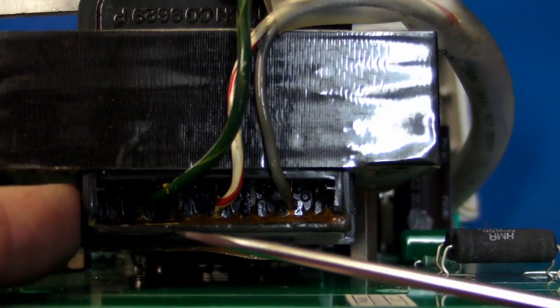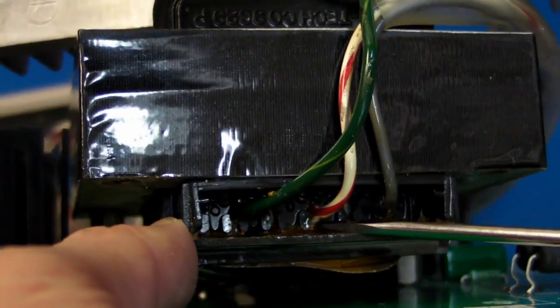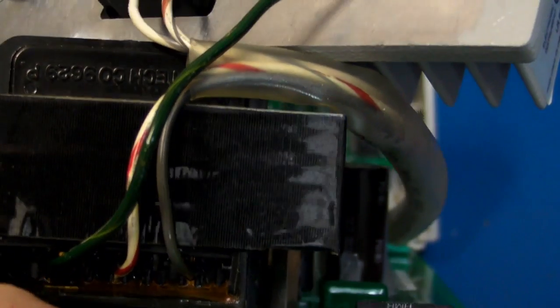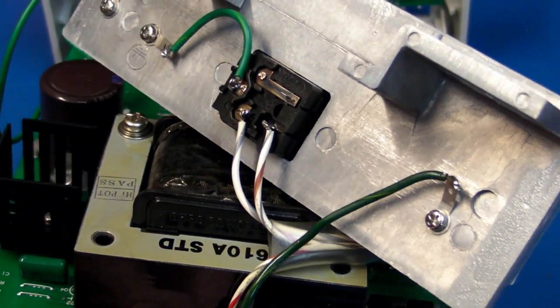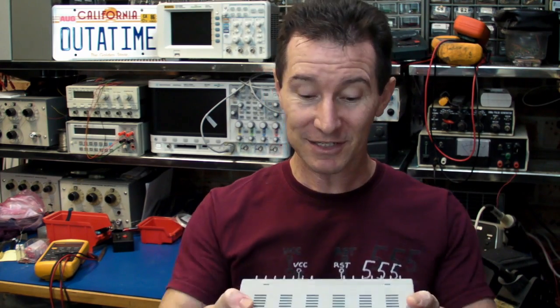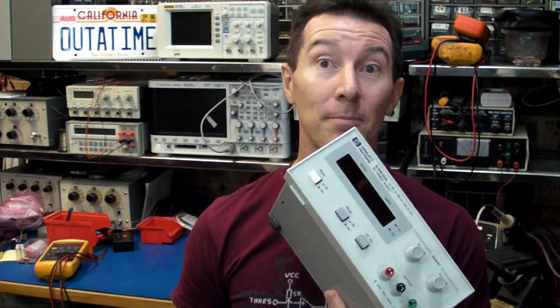I got the heatsink out and I'm massively disappointed. The wiring goes directly into the transformer — there are no solder tabs on that at all, no taps that I can change to 240 volts. What were HP thinking? They obviously use a different transformer for each market — they could have just had one with taps. That's a real bummer. It looks like they use a totally different transformer — that's why it's got 'standard' stamped on it. I think it's option 03 or something if you want the 240 volt model. Just beware of that when you're shopping around on eBay for these.